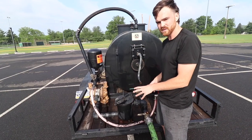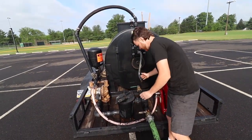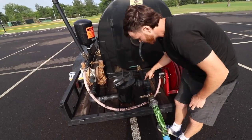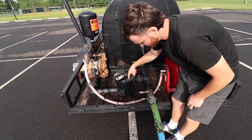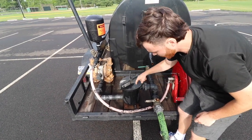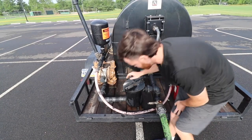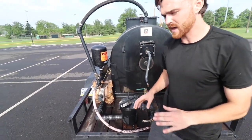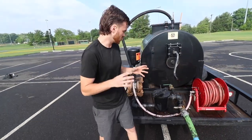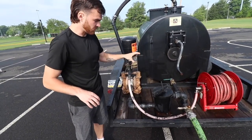You do not need all the bells and whistles. This was really for parking lots and we do high volume this way. We plumb the gear and then this is our strainer basket. The sealer runs through here and then runs through the bottom of the net to the pump. This strains all the chunks — if there are any chunks on the walls that fall in before it gets to the pump.